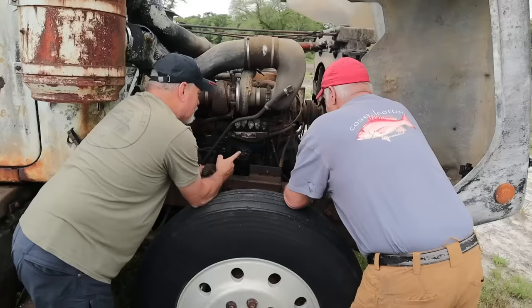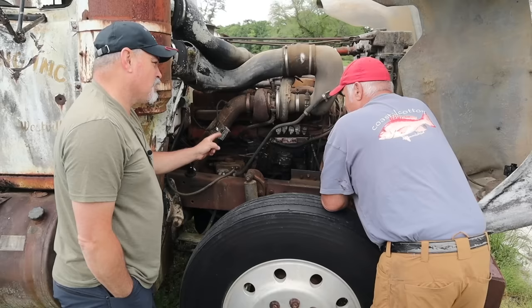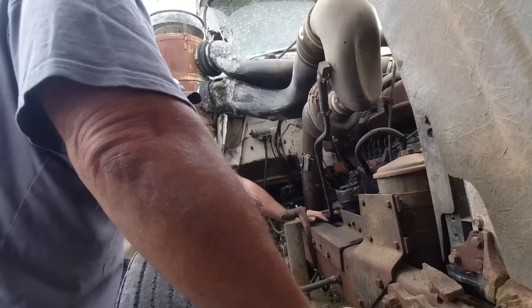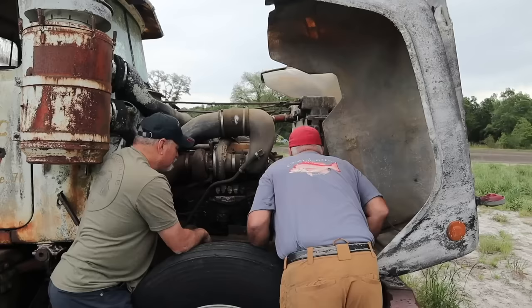I would think that you've got a one in two chance of getting it on top dead center, right? Don't the crank turn twice for every one turn of the fuel pump? Because it would go top dead center, bottom dead center, then the fuel would be dispensed at top. I mean, right before top dead center. Is that not right? You lost me. Well, top dead center on the compression stroke is what we're after, right? I think. That's got to mean something. See on top of that harmonic balancer.